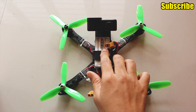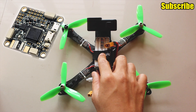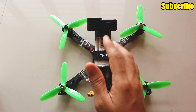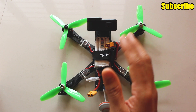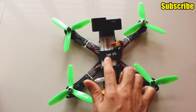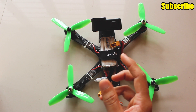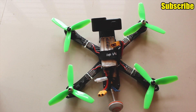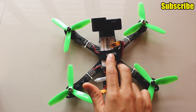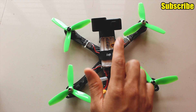After that is the flight controller. I'm using the Omnibus F4 V2 Pro flight controller which comes with Betaflight OSD, so I don't have to buy another OSD module to monitor stuff like RSSI, battery voltage, and I can also change some settings on the go. It also has a current sensor built in so I can monitor the amp draw, and it has an SD card slot to log black box data for further monitoring. I got the flight controller for $36, and I actually have two of these — one in this quad and the other in my Yeti XL RC car.